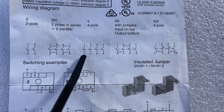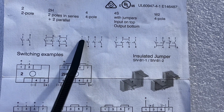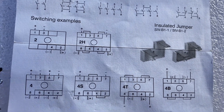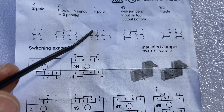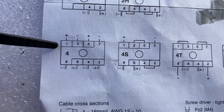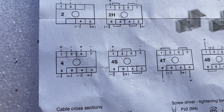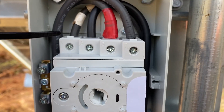The main thing I want you to understand with this switch, when using it in this configuration: terminal 1 goes to 2, 3 goes to 4, 5 goes to 6, and 7 goes to 8. Don't make the mistake of thinking the switch is built like the line diagram — that's just a line diagram. This is how the switch is actually built. I call it a crossover switch; I'm not sure of the proper name — rotary switch, I guess.